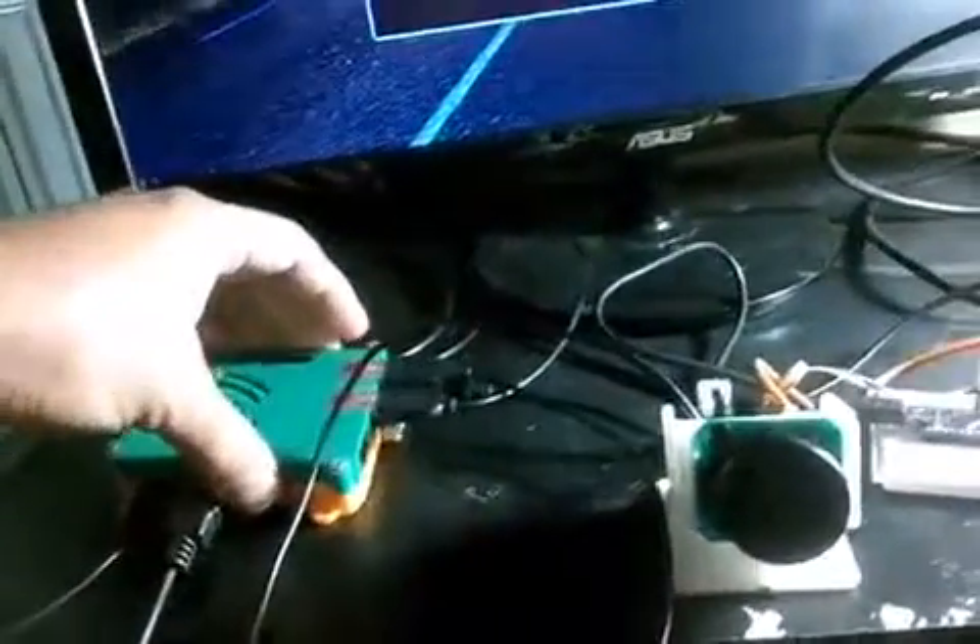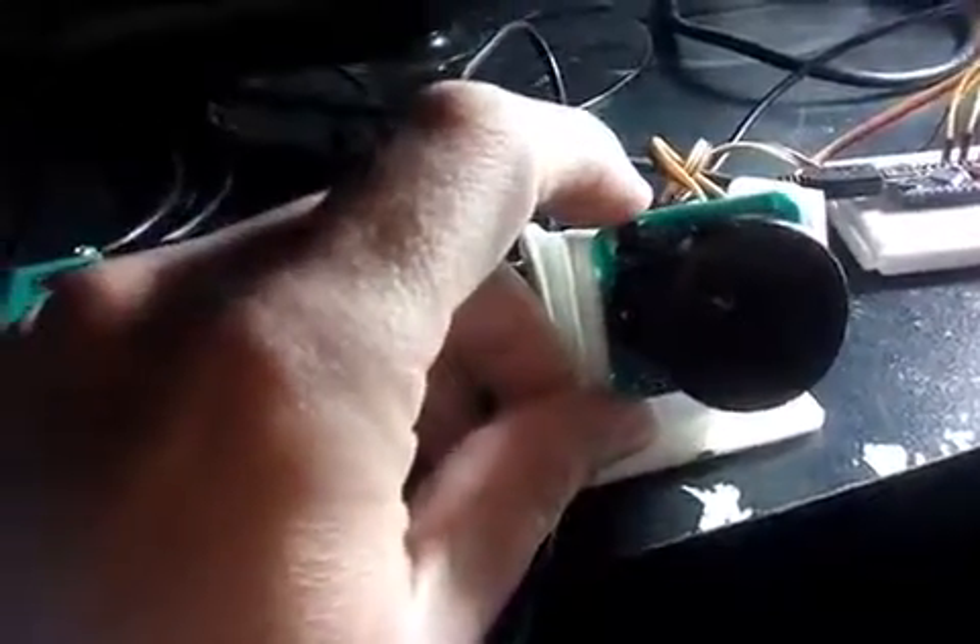I got here a Raspberry Pi 2, connected to that monitor there. The Raspberry Pi is connected to an Arduino Nano that is running a composite program of the servo and the ASCII parsing serial samples that come with the Arduino IDE. The Arduino is controlling two servo motors on this pan and tilt mechanism that I 3D printed. I downloaded the set of parts from Thingiverse but I added these little brackets to hold a Logitech USB webcam that I also connected to the Raspberry Pi.